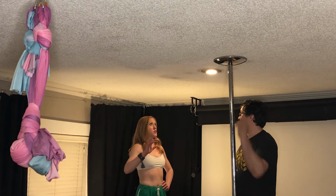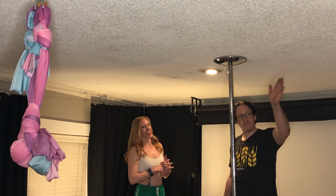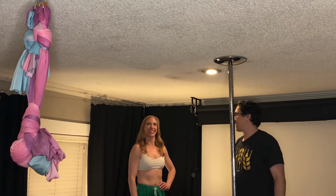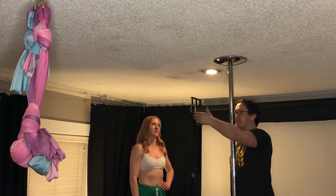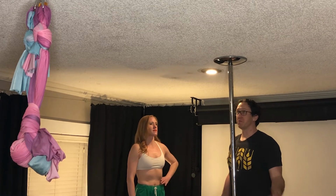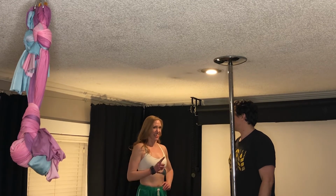I guess I was just confused between the difference between a joist and a support beam and a stud. So a stud typically is in the wall. That's vertical, where you hang the paintings. Yeah, if you're trying to hang your TV, you want to find a wall stud. Ceiling joists are kind of the same thing, but just 2x4s, sometimes they can be 2x6s, going across the room. It's what holds up your ceiling or supports your second floor. Soon to be a second floor.